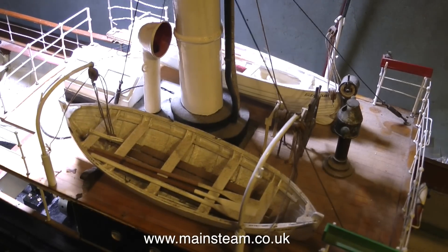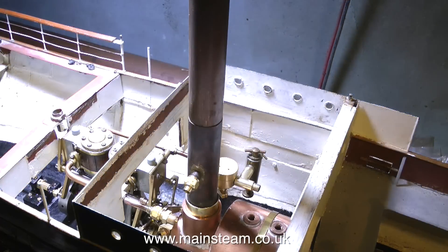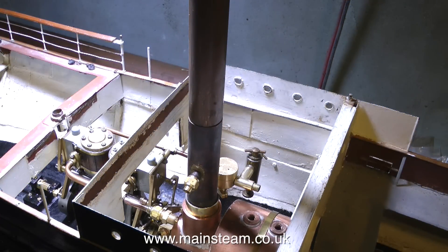What is going to be tricky is aligning the fitting over the safety valve, which in turn connects to a pipe attached to the chimney on the superstructure. When the safety valve does blow off, all the steam goes up this separate pipe attached to the superstructure instead of filling the boat with steam.